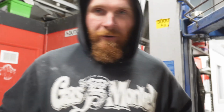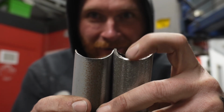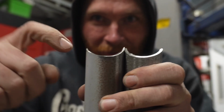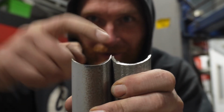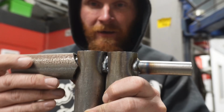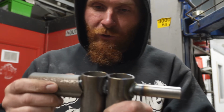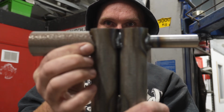So you need to file that so that the inner and the outer lip are the same. To show you what I mean, here's one I done earlier. You can see those bits are different to those bits. Also, the ends of these bits are thinner than those ones. Hopefully you get what I mean. And you also might need to file it a bit more in the dip area just to tweak it. But it ain't a million miles away already like that.